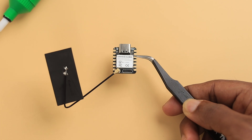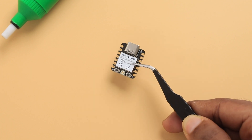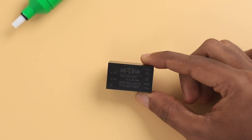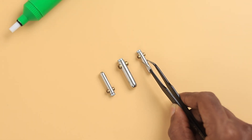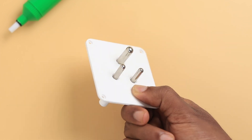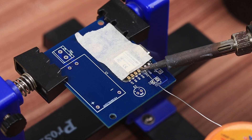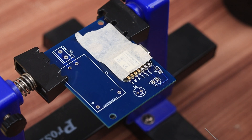The gateway is the only device powered by the XIAO ESP32-S3; all remaining devices are powered by the XIAO ESP32-C3. The 230V AC powers the ESP32-S3 through a HiLink power supply with some decoupling capacitors. We used three small pins to connect to the 230V AC so the gateway can easily plug into a socket. If you are replicating this, be cautious because you are dealing with high voltages. We then soldered all components onto the PCB one by one, screwed it to the case, and uploaded the firmware written in Arduino IDE.